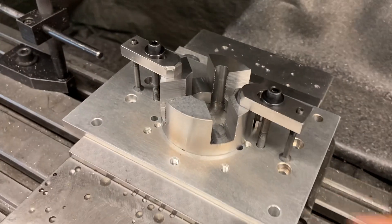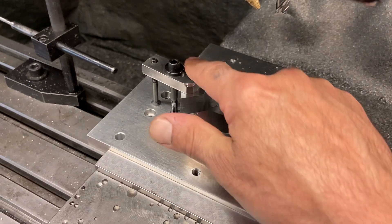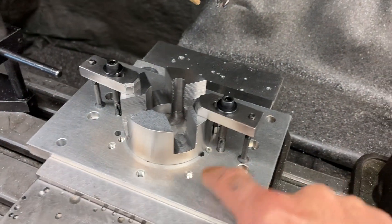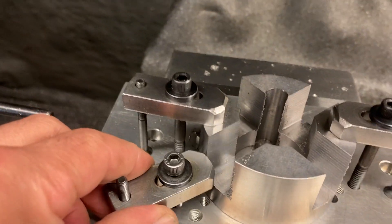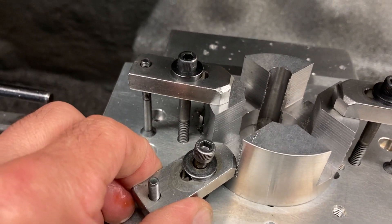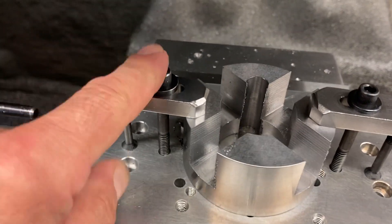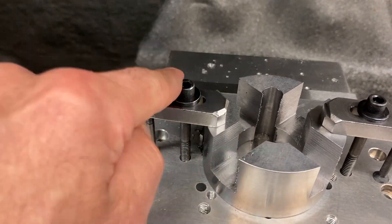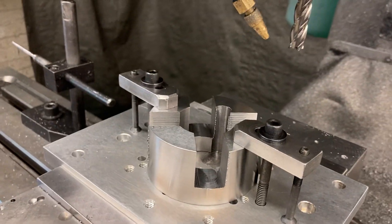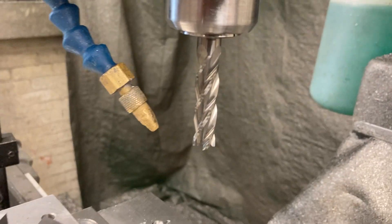Those slots — obviously I did the turning in the lathe. The OD and the bore through were all done in the lathe. I got to put some reamed holes in afterwards, so I knew I was gonna have to move this clamp. That's why we got extra tapped holes. I put my clamps down in here like that, because I got to move this one — reamed hole here, reamed hole here — so that clamp's coming out in the other operation.